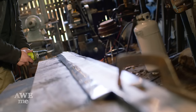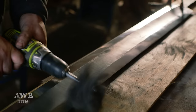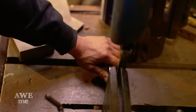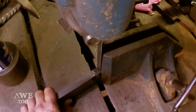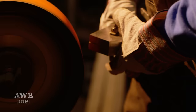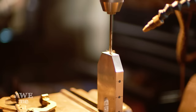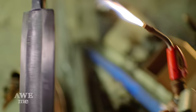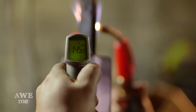I'll admit I thought I might need my brown pants, but I didn't. Sam uses a bunch of Scotch-Brite pads stacked up on a hand drill to smooth out the finish of the blade. John cuts the pieces for the guard — there will be multiple overlays with lots of rivets and everything has to look just right, so the sizing is very important. After cutting the guard pieces to length on the saw, John moves to the grinder to knock off the corners. Using the mill, John drills the holes on the sword guard, which is where we'll place our rivets. We're going to weld the guard on the Berserk Sword. Welding to the high carbon steel that the railroad track is made of makes for some different problems — due to the heat sink effect, we have to preheat the piece so that the effect is lessened, and then post heat.